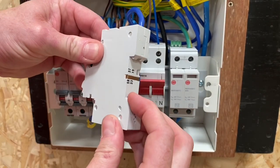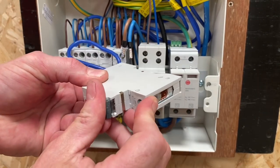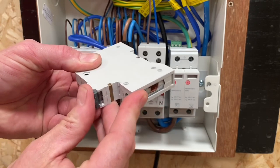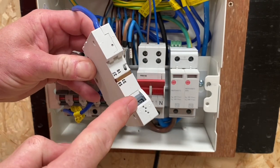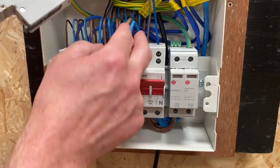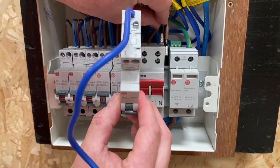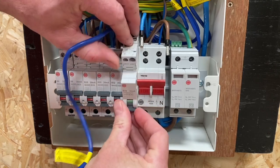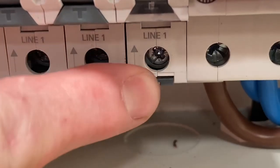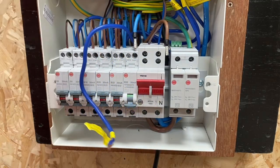We're used to this section here clipping onto our DIN rail at the back, so all we do is pull this clip forward and click it into position. If I just drop it off so you can see — you can pull it forward and the mechanism drops down, allowing me to fit it straight onto the bar without removing it. Move the conductors out of the way and drop that into position, push the clip back, and now we can tighten up our screws and insert our conductors as well as our neutral fly lead.